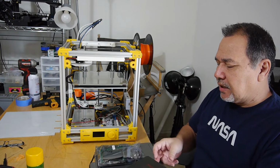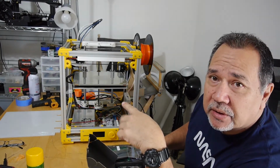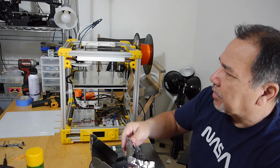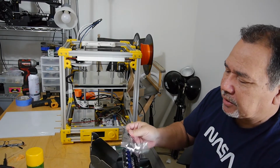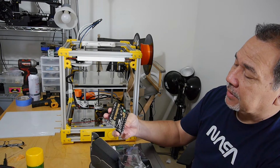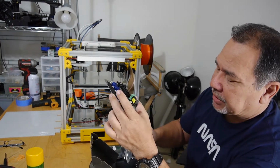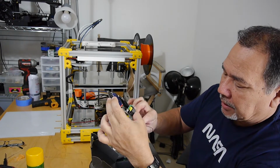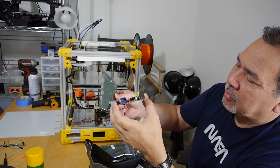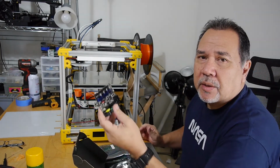So I started thinking, and I have a bunch of old parts, and I know I had upgraded my Ender 3s, and one of them belonged to a gentleman that had already upgraded and everything. I did all these so that they would match. Well, I ended up with a lot of spare parts. And this one, it's a Big Tree Tech E3 RRF version 1.1 or 1.2. I can't read it. But this is what he had on his machine, and it had the antenna for Wi-Fi and everything. As far as I know, it's still good. If not, I still have plenty of these stock boards for the Ender 3 Pro. But this one I would like to use because it has the 2209 stepper drivers on it, so it'd be a silent board.